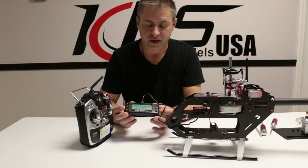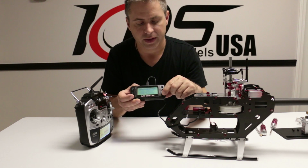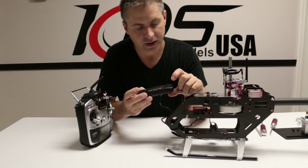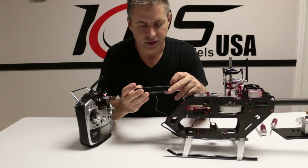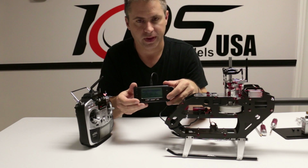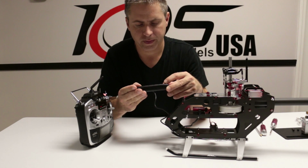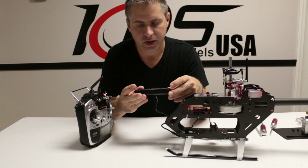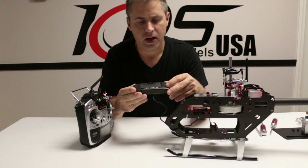The first item in the menu is bar monitor, and we have mounting. We have an up and down arrow here. You can see if we scroll down, the arrow goes down and up, etc. So I'm going to go down to mounting. The middle button here is enter. Once I've entered there, the bottom selection is RX device, which is number 4. I'm going to go down to number 4. Okay, I'm going to click enter, and then my choices are S-bus, KDS JR, and normal.